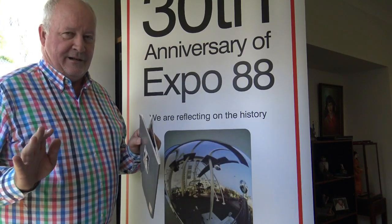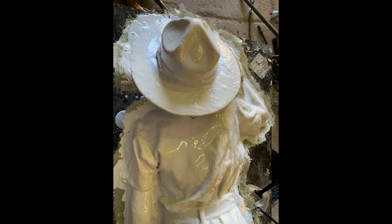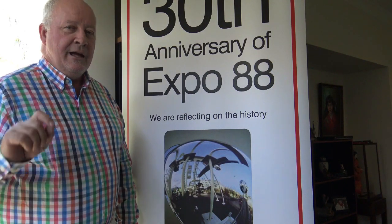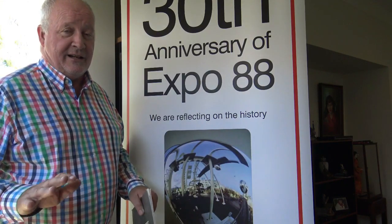What this video is about is to document the making — or the recasting — of the 'Be Prepared' Human Factor series Artbuster piece. We'll step through the process. These first photos show the initial step: the statue just after it was coated in a rubber solution to pick up the fine detail from the fiberglass statue. Then a fiberglass mat is applied over the back of the rubber mould to give it form and rigidity.